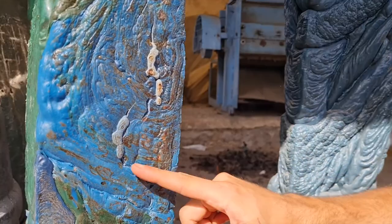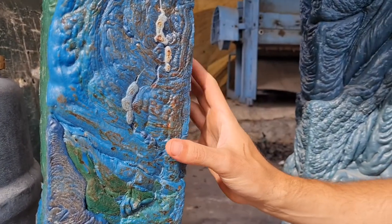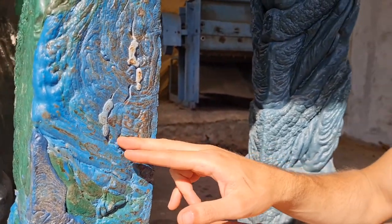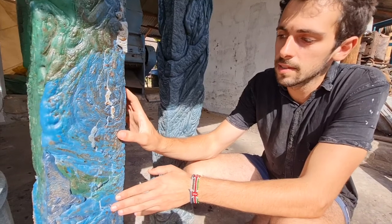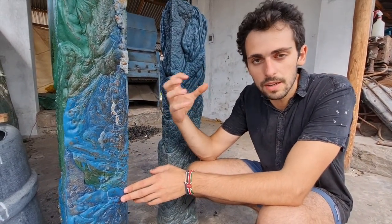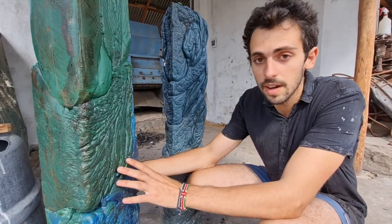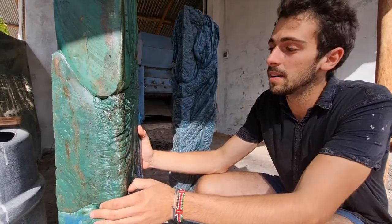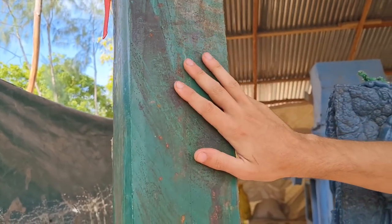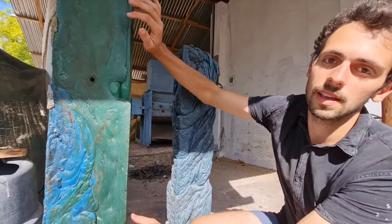One other thing that you can see here are these little cracks. And initially when we saw those cracks, we thought they were cracks that formed in the cooling and shrinkage of this beam. But what we guessed, and we think this is what's happening, is that while the extrusion process is taking place, the outside shell of these beams is solidifying, and then there's a pressure build up on the inside as more plastic is being injected into the mold, which continuously cracks the outside layer. And these cracks are undesirable. Cracks can propagate and cause catastrophic failures in the part, and so we definitely want to reduce that. And where the mold was hot enough, the outside layer never had a chance to solidify, and so you don't see those cracks forming. And so the goal is to keep the molds hot in order to prevent those cracks on the outside of the beam.